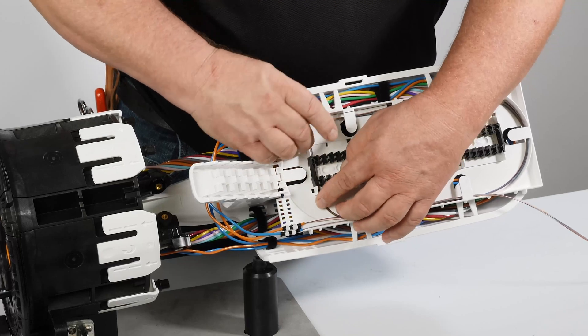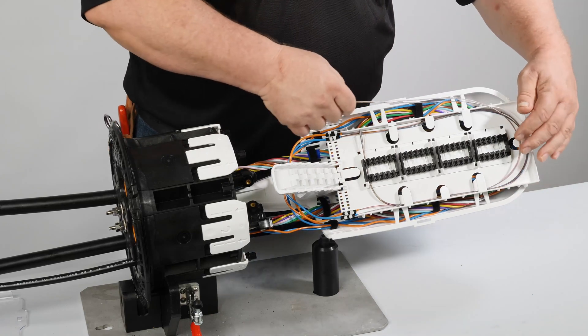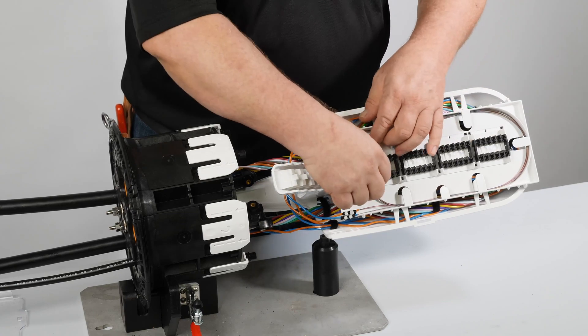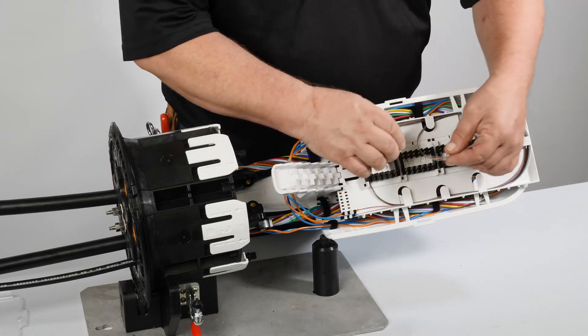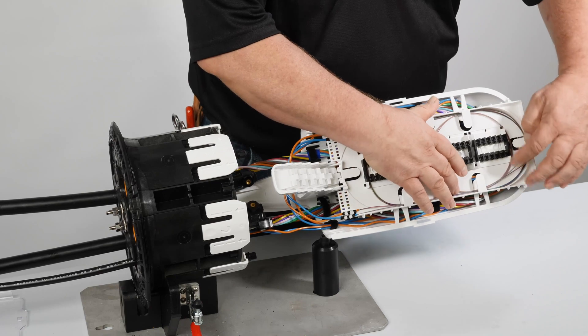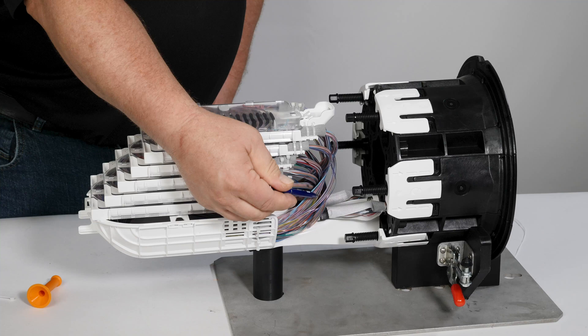In the splice tray there is enough slack to make a complete loop before splicing. This is applicable for all types of fiber: loose tube, ribbon, or spiderweb ribbon. Fiber trays have removable splice chips as well as interim pathways to improve fiber routing options. Fibers or tubes should exit the basket and cross behind the APEX splicing yoke to secure to the tray on the opposite side. This defines the proper slack when opening trays.